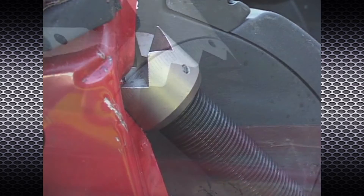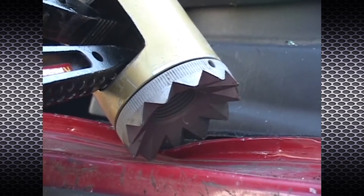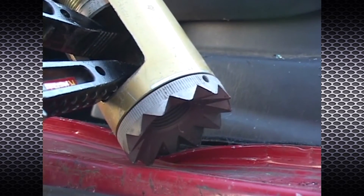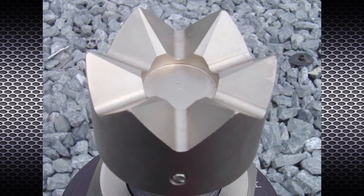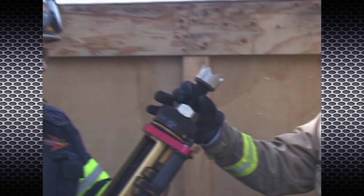The standard supplied head and foot adapters are unique and specially designed to engage and safely secure the working material. The special grade steel teeth will grab the working material as the load is applied. The V-slots that cross the adapter's diameter can be used to engage L-bracket pins and other objects. The swivel adapter set enables angled operations for stabilizing and shoring. To remove a head adapter, hold the secondary extender so that it does not spin and turn the head adapter slightly in either direction to disengage.